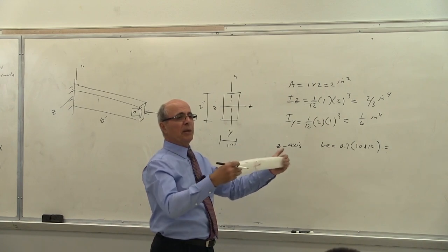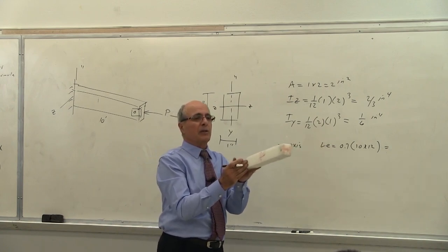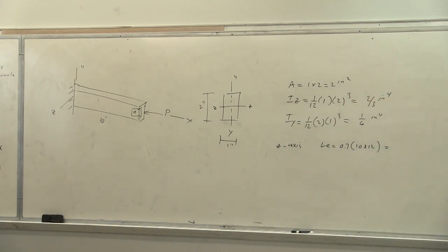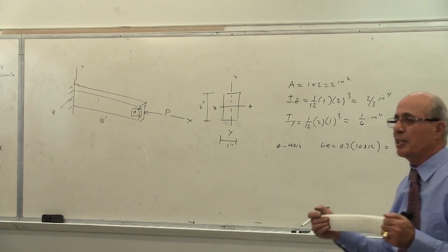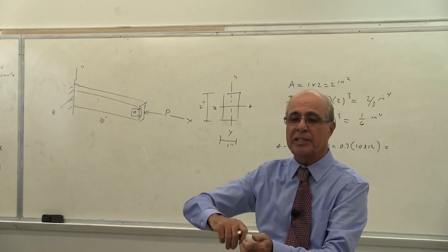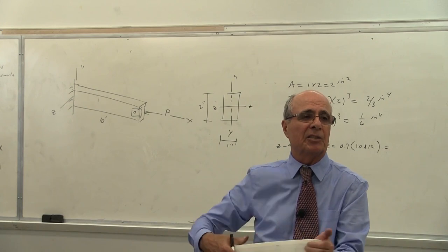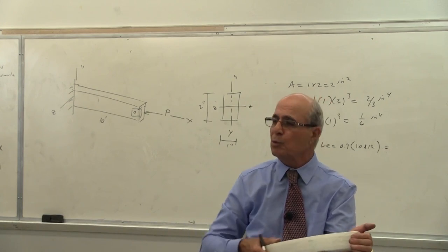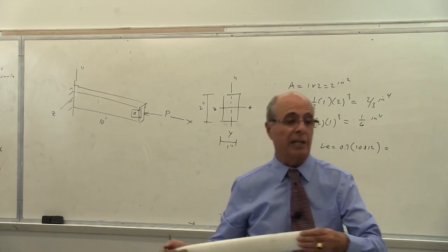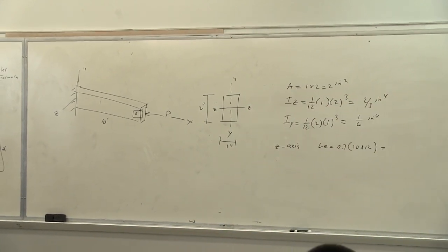Now, buckling this way, those two plates here, although it looks like a pin, this is what somebody asked me, whether this gets closer to real life. I said, yes, this is something we always consider as fixed-pin. Now, one direction is fixed-pin, the other direction is fixed, because two plates going like that, and you tighten this bolt there. Everybody understand that this side does not have room to rotate? Is that because those two plates, if it is tight there, will not let it rotate? Is that correct or not?